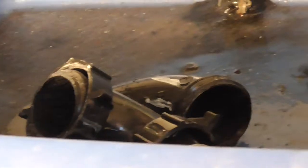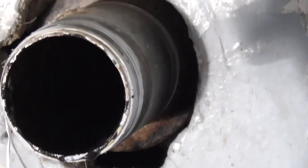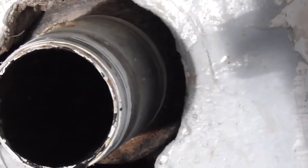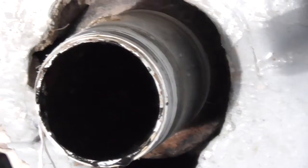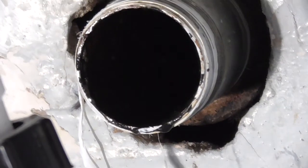This is the kind of crap you'll see in your pipe when you open it up. Normally things aren't this bad — normally you have dirt in the pipe and a big ball of hair stuck in the trap. This new pipe is only about two or three years old, attached to the old metal pipe. You can see where we're attaching plastic to metal, there is some pipe tape. There's no Teflon tape on plastic-to-plastic, only on plastic-to-metal. So I'm going to remove the old tape and wrap some new tape on. When you wrap the tape, you want to do it clockwise, because when you screw the pipe on it goes clockwise — if the tape is on backwards it's not going to seal.